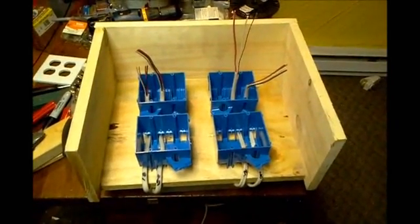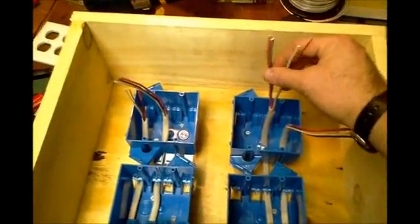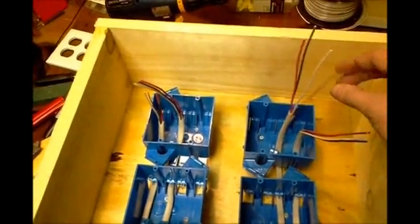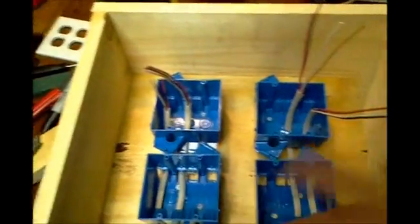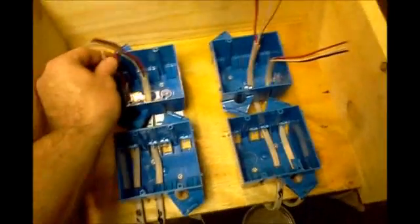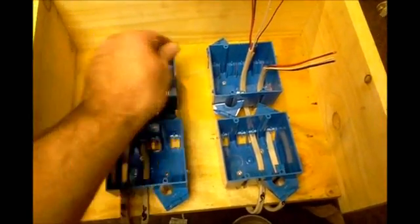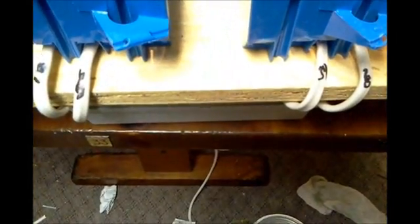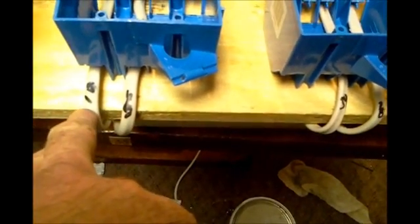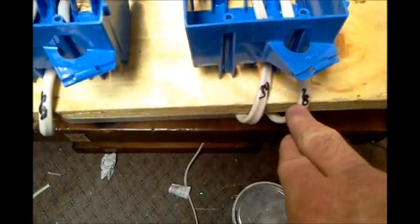Here is the next step: I have run some wires. These are 14-3 wires. I've got two hot wires, the neutral, and the ground, and I've done that for all of them. Because I used 14-3 wire, I saved the amount of wire that I ran. I have a lot of 14-2, but 14-3 has three wires — it's less running of wires. This is exterior 14-3, and I labeled them which channels I've connected them to. I've got channel 1 and 2, channel 5 and 6, channel 3 and 4, and channel 7 and 8.